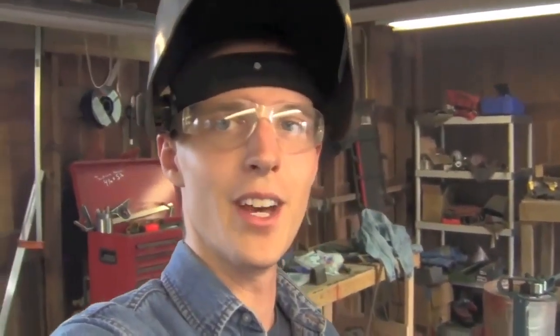Don't get your head in the smoke — I tried that when I first came out here to experiment and had to stop because there was so much smoke going into my eyes it stung. So if you're going to cut with a stick welder, get your head out of the way, crank your welder up, and just buy some 6011s. Don't spend money on those cutting electrodes — that was an absolute total waste of money. Maybe some other company throughout history has made better ones, but the Hobart ones just don't work. I don't like making negative reviews, but I just can't say anything good about those electrodes.